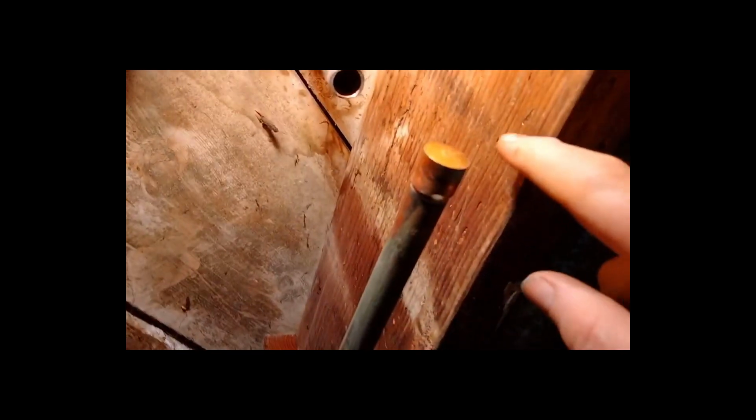Alright, now we're underneath in the basement, inside the cold air return. So there's a piece of metal that covers this entire thing. So none of this is visible really, when you get done, so nobody will care what it looks like. But the first thing I have to do is get these caps back off. I put those on when I started the job because I had open pipes and I needed to still use water for a while I was repairing it.